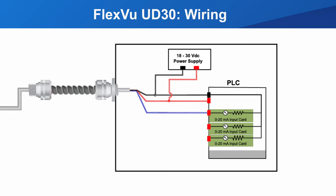The HART specification requires there must be a minimum of 250 ohms resistance in the loop to develop the HART signal. Typically, input cards have a 250 ohm resistor in the input as the card converts the 4 to 20 milliamp signal to 1 to 5 volt DC. This is enough resistance, so there are no other external resistors needed for HART to work.